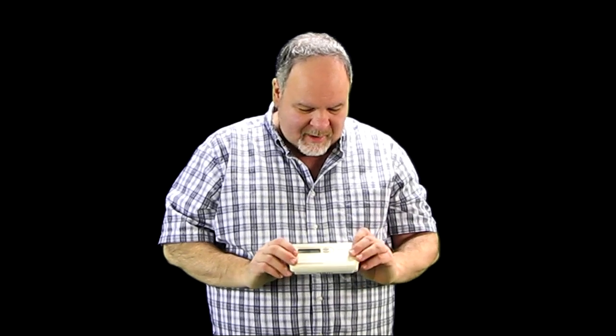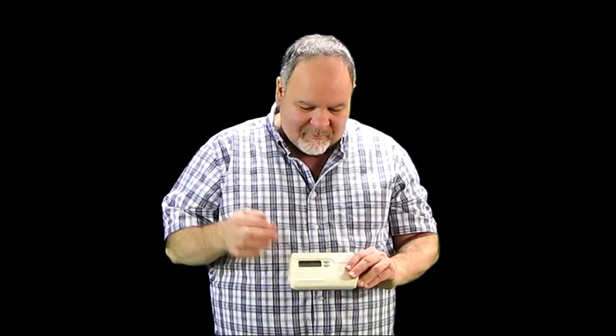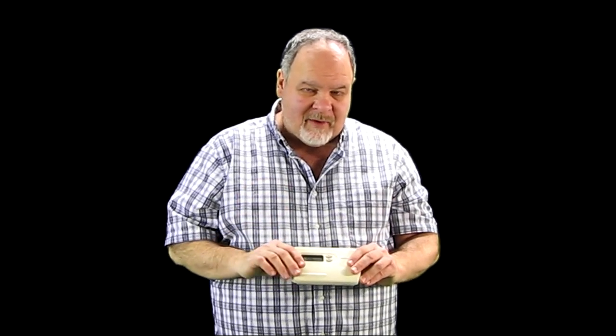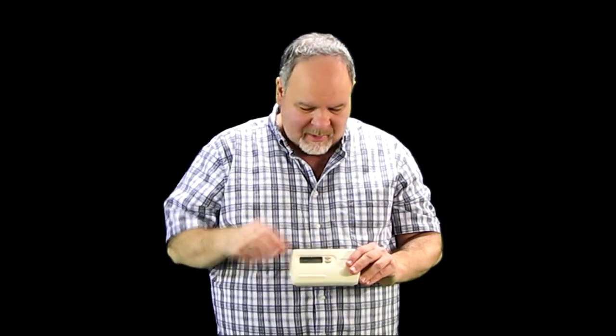So I thought of it last night and came up with a simple solution. I have a backup White Rogers thermostat, very similar to the one I'm using in my house. I thought: what if you could put a piezo alarm wired up very simply inside here that will go off whenever this demands heat? I'm going to show you how to wire it up and give you a wiring diagram — it literally is two solder connections and two screw connections inside the unit.